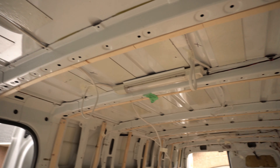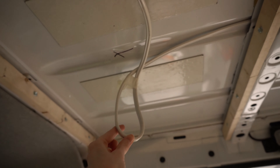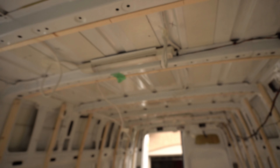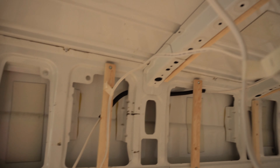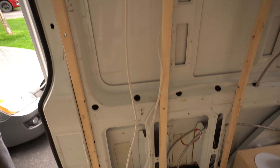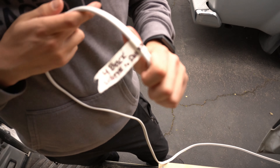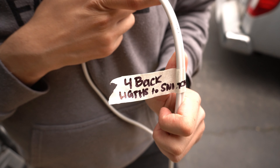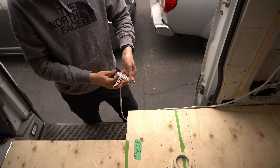We are working on the wiring today, hopefully doing it right. We're using 14-gauge wire. The X's on the diagram show where our pot lights are going to be — pot light, pot light, and so on. All those wires are running back through the wall to the light switch. Just make sure you label them all so you know where they're going. Our light switches are going to be right there when you come in the door.